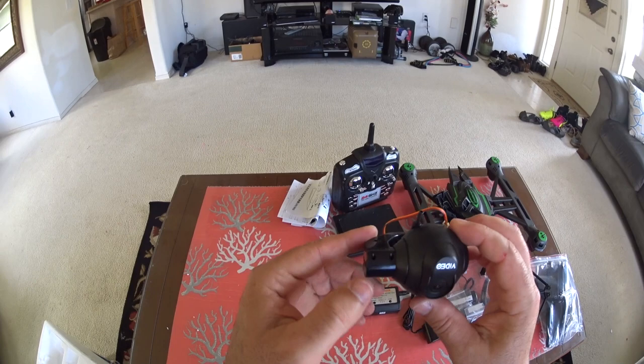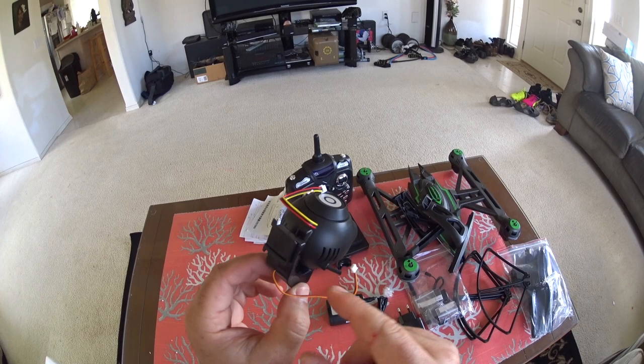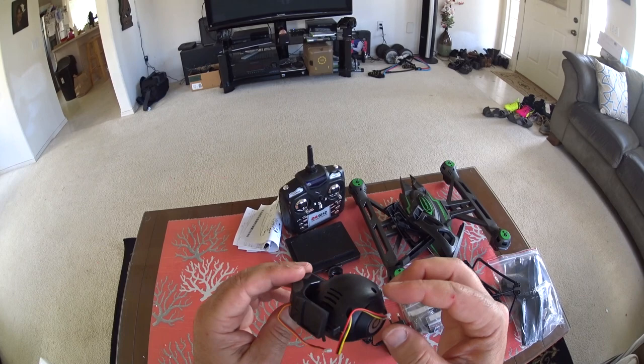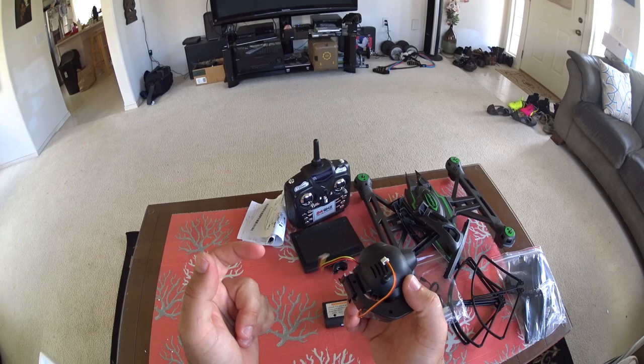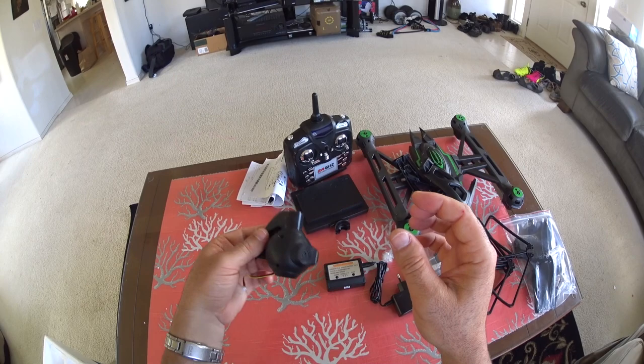This camera — oh yeah, cool. You can hear that in the mic. It does have a servo in there, a little mini servo that's going to enable remote tilt. It looks like this has the whole FPV system built in — I can see this little antenna hanging down for 5.8 gigahertz. We've got two plugs to connect to the bottom of the craft — probably one for FPV and one for the remote tilt. This thing is super light, barely weighs anything.